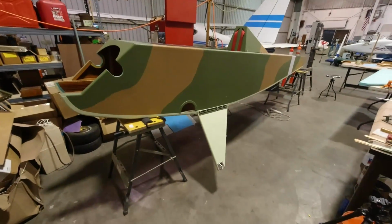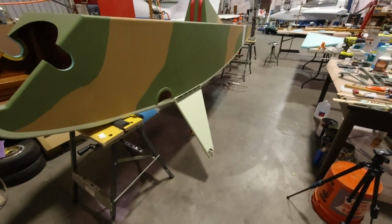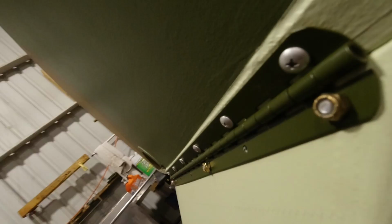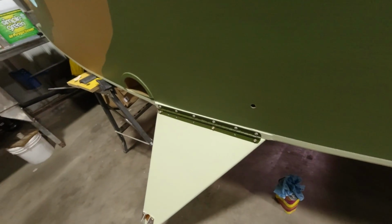All right, so I got that gear leg on. And that's as much as I can do without the correct screw, and you can see I just don't have one thread coming out there, so I'm gonna have to find a size that's just a little bit bigger than a 20. And I have the same situation in these two center ones. You can't really see those, but I don't have at least one thread coming out there.